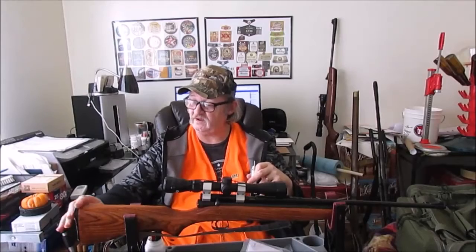I've got to get this thing back together today and hope it holds CO2 so I can use my new deluxe chronograph down there with the IR LED lights. Infrared lights. You can't actually see these infrared lights, the little loop things, are on, till you look at a regular red colored LED in the end of each light where the little wire plugs in, to let you know that the infrared lights are on. So if these other regular red lights go out, then you know that something's wrong, because they're wired in series, like the old Christmas tree lights.